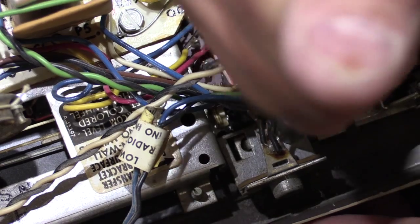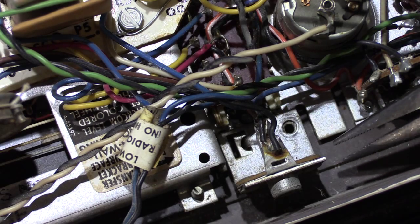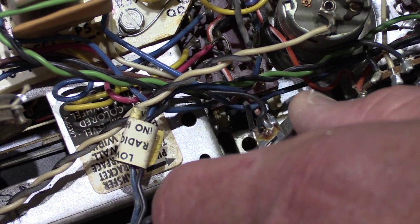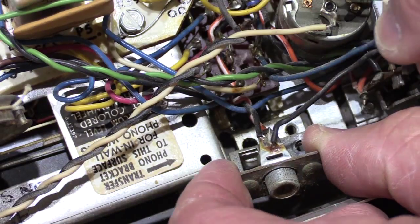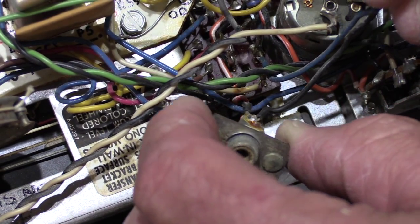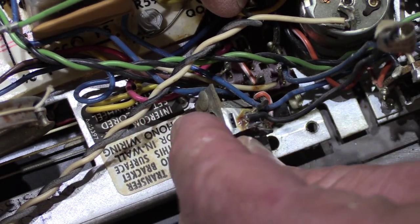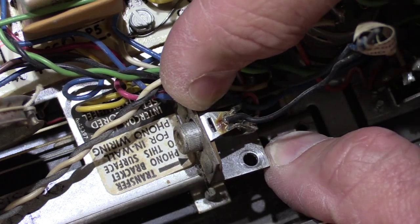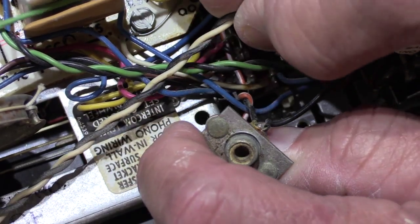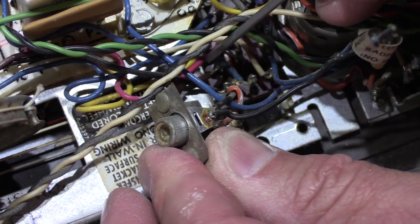Alright, so if you loosen the screw with the nut driver. Take it out. You can take the bracket with the RCA socket on it and lift it out of its position. And of course, like all things NuTone, they could have made the wires a little longer, but they didn't. So what are you going to do? But they're just usually barely long enough, barely being the key word, to swing it around, and it's going to fight me, it looks like. Let's see if we can make a little more room in here. Alright, we'll move some of the other wires out of the way.